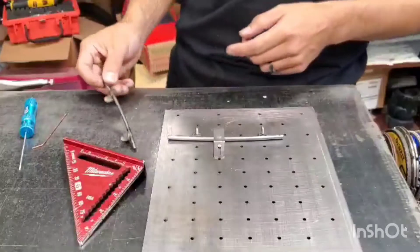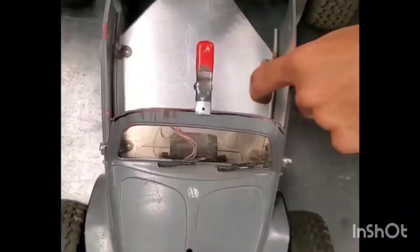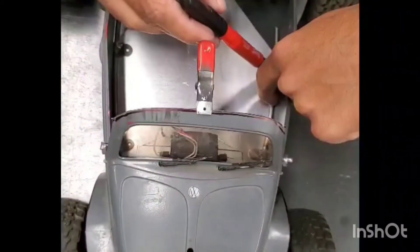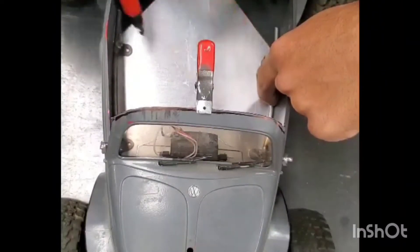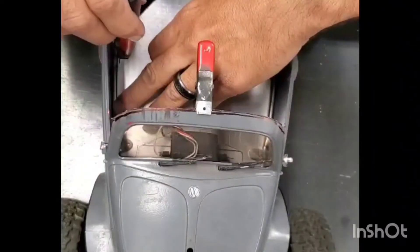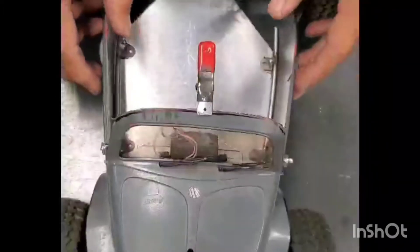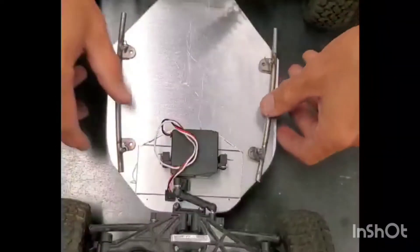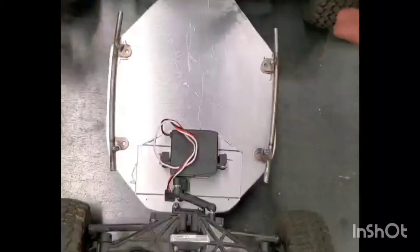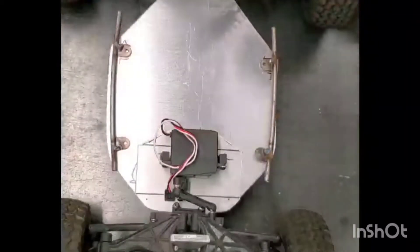With your pieces in, we're going to make a couple of reference marks with your marking device — I'll mark the corner here and the corner here so I can set it back up. I'll better mark it with the body off, but this is just for alignment purposes right now. Obviously, before you do this make sure the body is perfectly centered on there. Now we can better align that up, put a clamp on here, and make a mark for those holes.